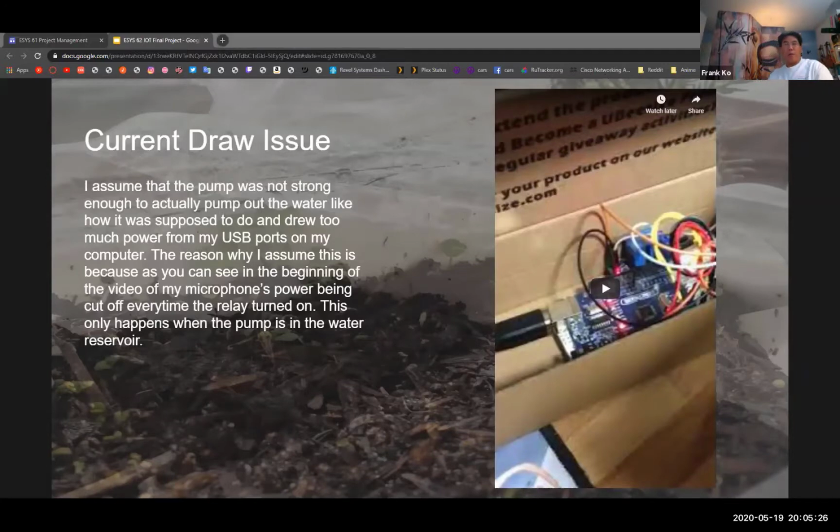But your relay does, because you had a program, you had a relay that was clicking on and off, and the relay is controlled by the Arduino, yes? Yes. Okay, what's the other side of the relay hooked up to? The other side of the relay gets its power from Arduino, goes to the relay, and then the motor, it goes from the normally open switch to the COM port. And once the relay goes on, okay.